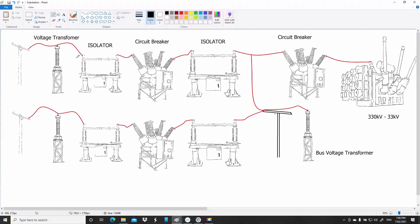Then we have an isolator. When you want to isolate your circuit you want a visible break, so you can actually see that your circuit is not energized. You can't always get it, but it's really nice to be able to say this is off, that's open, and then there's a set of earths attached. What actually happens is one part will go this way and one part will go this way, leaving a massive air gap that the electricity would have to jump across to energize the other side. You'd also have a set of earths — they come up towards whichever side you're working on.